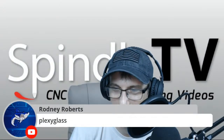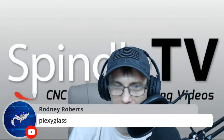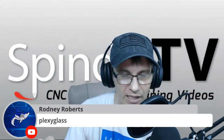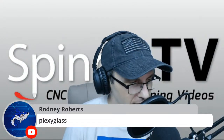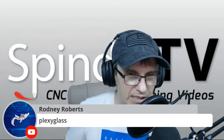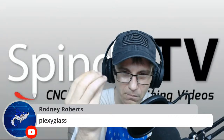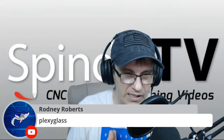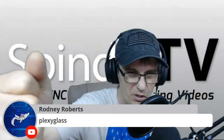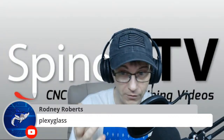Plexiglass. Plexiglass is what P-glass is. Thank you very much. Can what be carved on plexiglass? We can carve on plexiglass, but you don't want to. It's extruded plastic. You want to carve on cast acrylic. Plexiglass you can carve and engrave and all that stuff. But with it being an extruded plastic, it melts, it chips, it breaks easily. You kind of want to steer away from it, because that molten ball of plastic on your bit builds up, and you have to babysit the CNC, stop it, and pick that plastic off the bit. If you don't, that molten plastic is just going to push through the rest of the material. You want cast acrylic, preferably, on a lot of things.